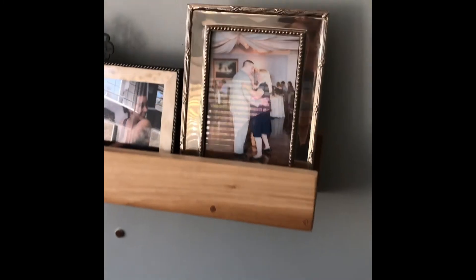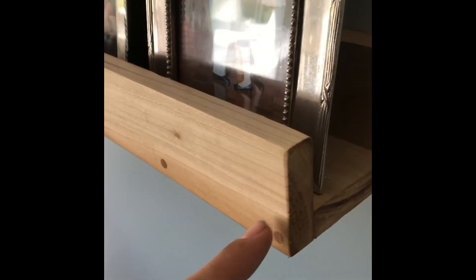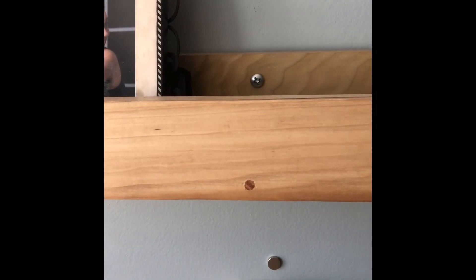Some people just go up and knock, and you can feel when you get that high pitch you're getting closer to a stud. But I know that we've mounted the drywall to the studs with screws, and those are definitely in the studs. So I use magnets to find them — just little rare earth magnets that I search around the wall. Once they stuck, I knew I was in a stud. These shelves here are just three boards — butt joint, butt joint, butt joint — and I shot little tenons through them with dowels. Those are held onto the wall with wood screws going directly into the wall. I left them exposed because they just get covered up by beautiful pictures of my wife. We can probably safely say there's a stud behind that wall.